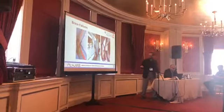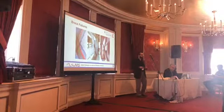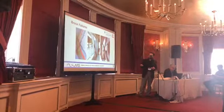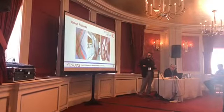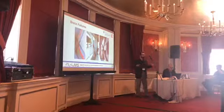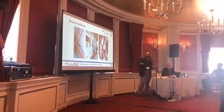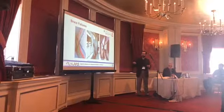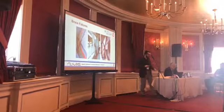So these are just typical failure modes of conventional bracings, which involve both in-plane and out-of-plane buckling. And as I said, even if it doesn't lead to complete collapse of the building, you will eventually need to replace these elements, probably also the neighboring elements such as beams, columns and joints, which imposes huge economic losses.